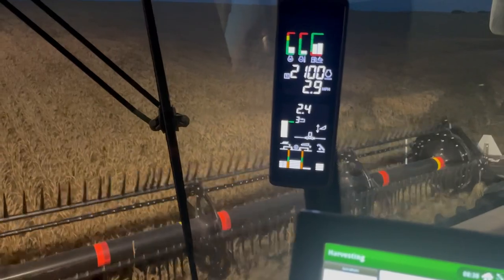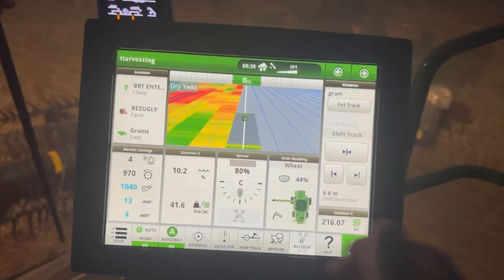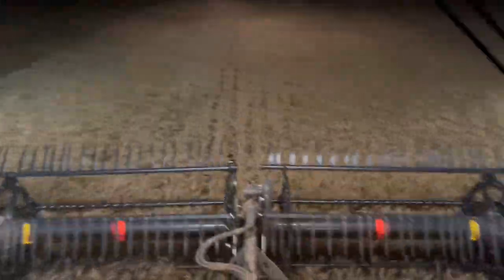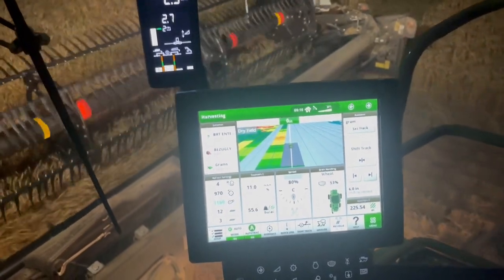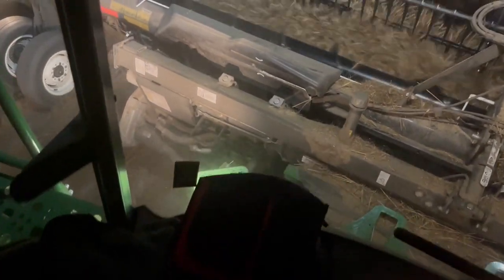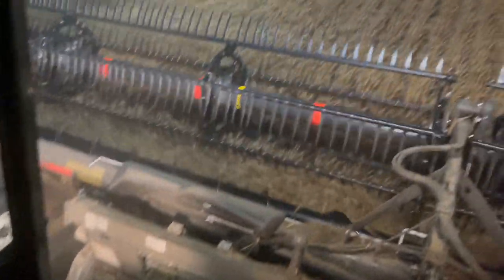Had to slow down a little bit — must be getting cooler out, down to 2.9 miles an hour. 64 degrees outside, that's like 16 or 17, I think it was like 26 degrees today. Here's my late night tips and tricks — it's only 10 after 9. As an operator, you're always watching for oil leaks or something wrong with the combine; you're always listening for anything out of the ordinary. With this big screen here, you always gotta remember to check those tires, because I've had a flat tire there before and this screen blocks it. Also my lunch kit sits here — you gotta remember to peek down and see your PTO and your header connections, because I've had a massive oil leak there before and I didn't see it cause I was staring at my lunch kit. That is my late night tips and tricks.